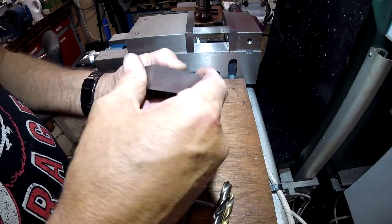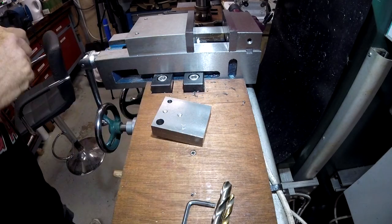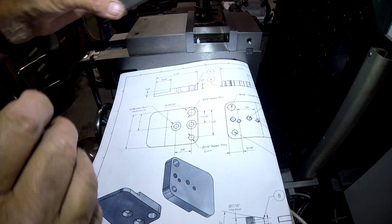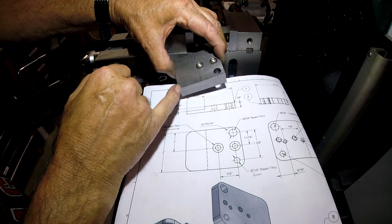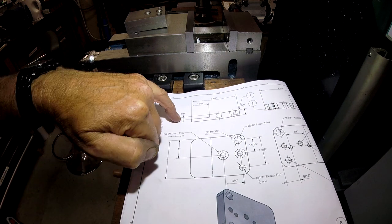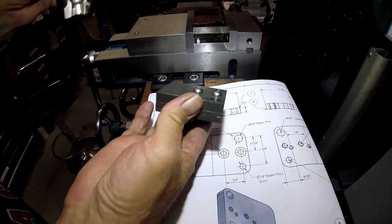And I could machine my radiuses on them both together. And I can machine my slot in there and my slot in there, which I'm sure were 3/16 deep. The slot is 15/16 of an inch long, so that's along there, and I'm sure it tells you there, look, 3/16, so it's 3/8 material, so it's half of each piece of material, so it's quite simple, isn't it? Slot and slot, and running backwards and forwards, it shouldn't take too long to do.